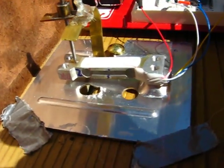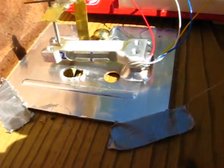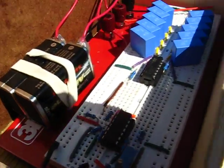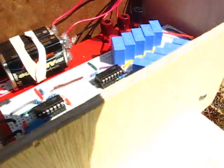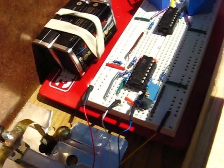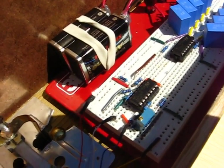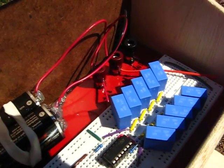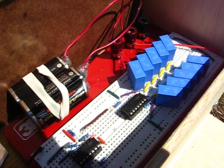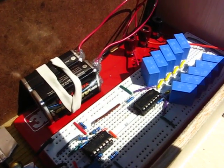See that little nail — it's adjustable. That signal — it's a Wheatstone bridge — and that strain gauge is hooked up to this circuit. It's not on right now, but if it were, there's a small signal coming out of that blue and white wire that goes through this instrumentation amplifier setup. Then it gets low-pass filtered to the point that you could actually pick out the weight of a bee from all that noise.